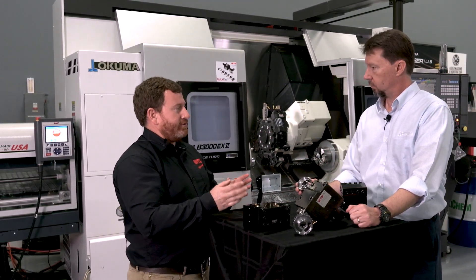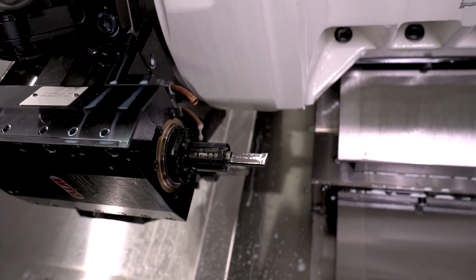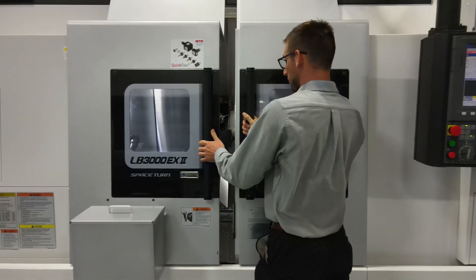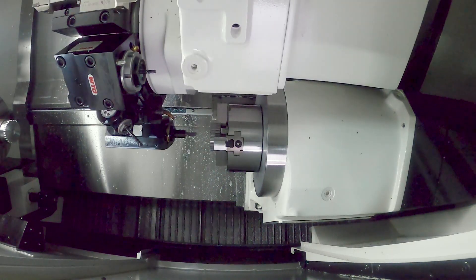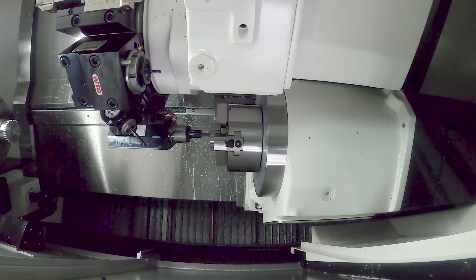It's a 35 millimeter total stroke, but we need 32 millimeters of effective stroke because at each end we need 1.5 millimeters of free travel — so about a sixteenth of an inch of free travel and about an inch and a quarter total stroke. That free travel gives you a little lead in and lead out — when the unit comes past the end of the cut it can lift without pressure, then re-engage freely and make the cut.